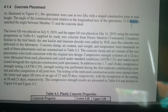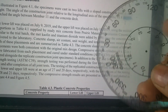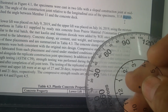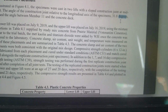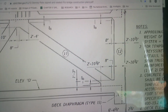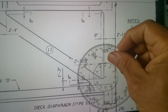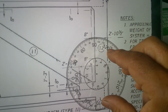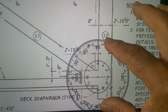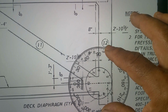You guys can do that yourself. You can grab anything you like, like this guy here, and put it on there and square it up. This has a 90 degree and a 0 degree right here. So I line up the 0 and the 90 with a dot where they meet together on the structure, and then I can use that as my reference point, and I come up with 34. One more time, I'll line up with this, and I'll put the dot on there where they meet, the center dot. I have other things I can use, but I think this one was best for this video. So I line up the dot, I turn the 90 to touch, and if this is squared, it'll just about reach the 0 there too, to the left.